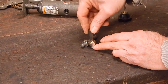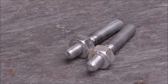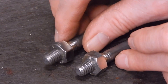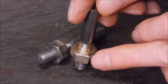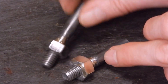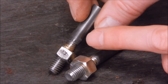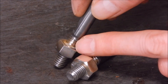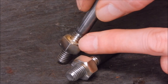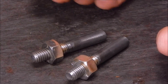On the back it turned out reasonably okay. You can get a bird's eye view there - yeah, turned out good. On the back you can see where the bronze ran into that depression we machined. You could use them like that, that would be quite alright, but I'll just clean them up in the lathe with a parting off blade to get a nice flat finish on the back. Then just cut them to length when you go to use them.